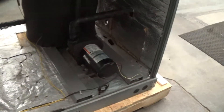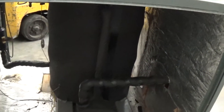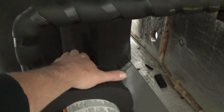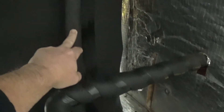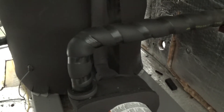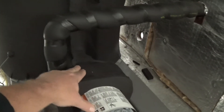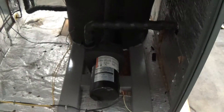The units have a pretty impressive single-phase one-horsepower pump. When we get these ready for a low-temperature application, we insulate the pump and that line. This is the suction side drawing off your tank, and this outputs out to your process. We also have a fixed bypass line — that little fixed bypass line is so if you have any major restrictions in your process, or if you shut off all your valves, it protects the pump. We're always going to have some type of flow in this centrifugal pump coming back up to the top of the tank.